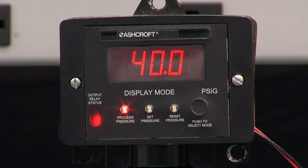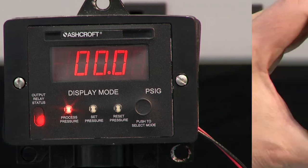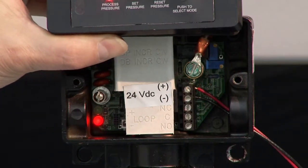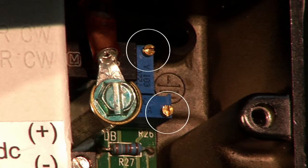I'd like to demonstrate how to set the switch. I'm going to remove the pressure at zero, because no pressure is needed to the switch to set it. I'm going to remove the cover of the switch very carefully because it is connected with a wire, so it is very important that you hold on to the circuit board. Carefully raising it up to expose the two potentiometers.